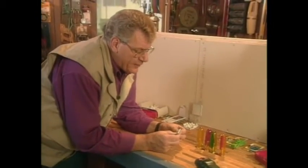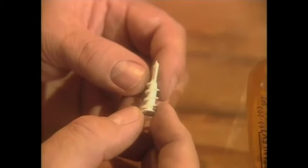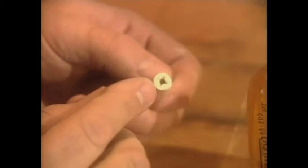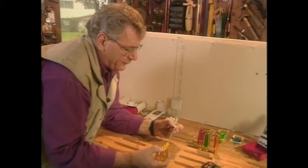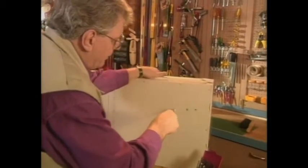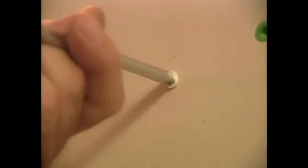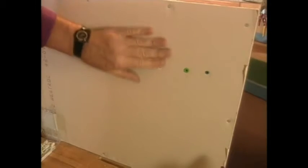This one here is a hollow wall anchor called the easy anchor. It's really fast to put in — it's got a very coarse thread and a very sharp point, and it takes a Phillips screwdriver. It's that simple: you take it to the wall, push, and turn. You're screwing it right into the drywall — it makes its own hole, and that coarse thread gives you a nice tight fit, all ready for a screw to go into place.